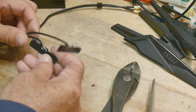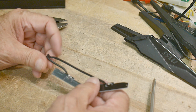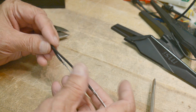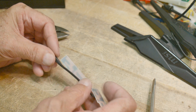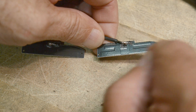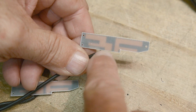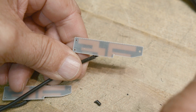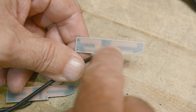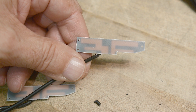Let me zoom down here. Ground comes in and attaches here, and then the center attaches to this one — so it's like a dipole, a this-a-thing here and a this-a-thing here. If you turn it over you can see the actual metal — the light pinkish stuff here is the metal. So it's like a folded dipole, but like an F — an F going that way and an F going that way. Interesting. I have not seen that type of antenna before.